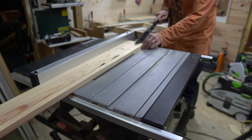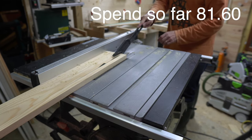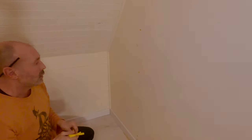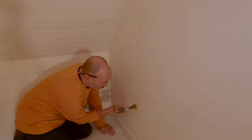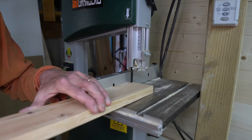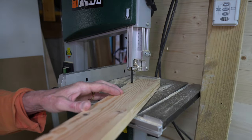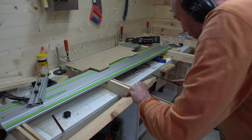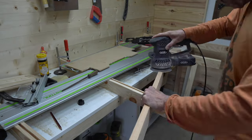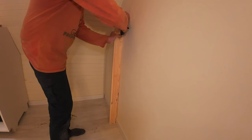To make the grounds and the side cheeks I'm using two pieces, so that's another 10 euros. I start the fixing process from the right hand end — first I fix the ground to the masonry wall, then I also fit the ground to the left hand wall. I then prepare the right hand front facing and for this I need to scribe it over the skirting board. I cut the scribe mostly at the bandsaw and then finesse the curve with a round rasp.